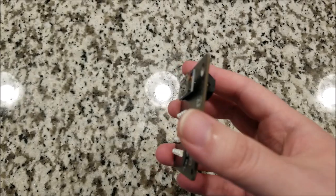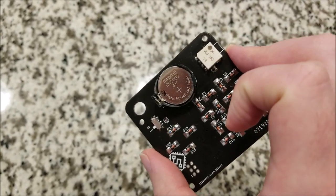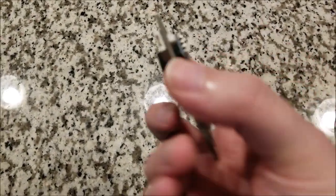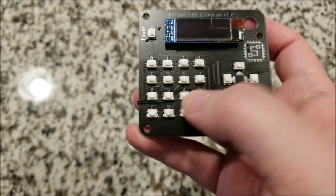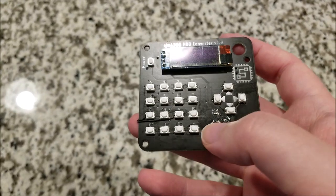And there you go. I'm probably going to design a little 3D printed case with a hole so you can still access the button cell and replace it. One thing I did an oopsie on: I forgot two extra wires that I needed. I was going to place vias on them and I never did, and I'm guessing I didn't run a final check of the board before placing the order. I was kind of in a rush.